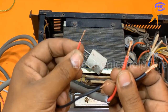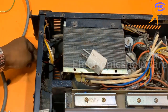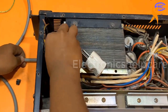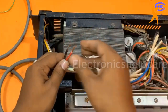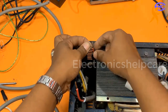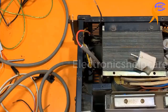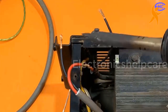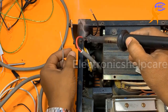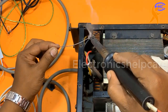Don't use poor wire — always avoid poor quality wire for this type of amplifier. I don't know who used that wire; maybe they didn't know better. This new wire can take a minimum of 10 amperes. We have to clean the connections first — always solder the wire nicely.